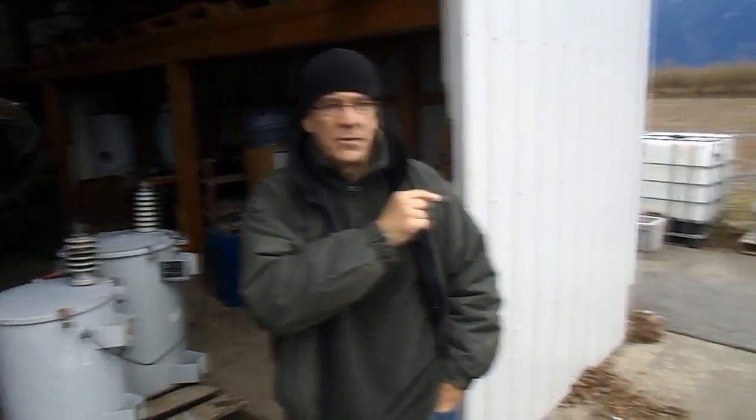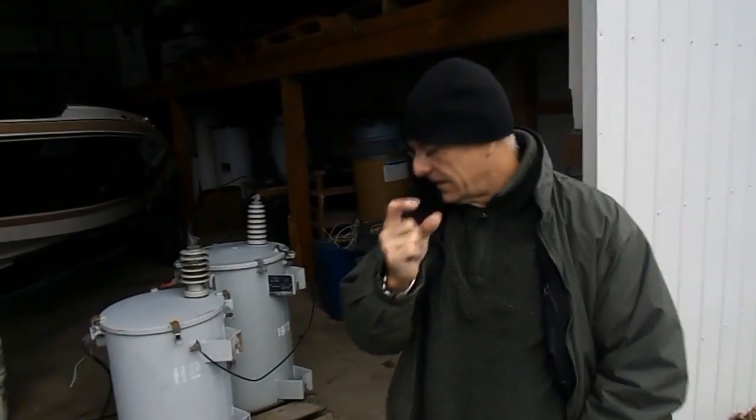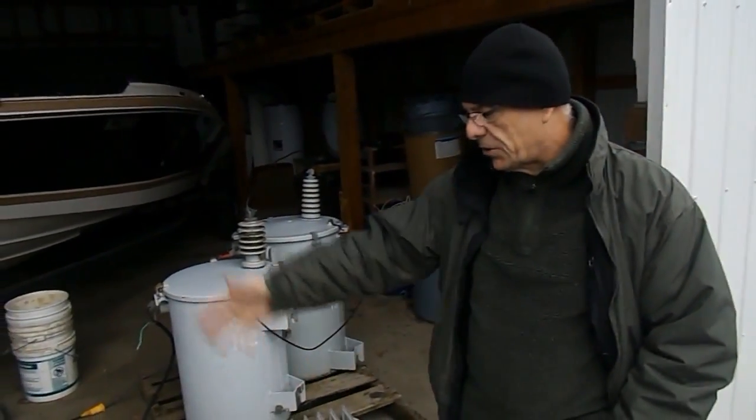Well, we're going to cut it off slowly, and just remind, we've done a lot of talking, but we're starting with a very small amount of energy, with a 30 amp fuse, which at 32, 33, 34 amps of demand would have burnt out. And when you load everything and you create a demand of 5,000 watts, and it's still pushing out, it might work harder, but it's still pushing out, and that fuse is not burning. Now, for any electrician, this is hard to believe.